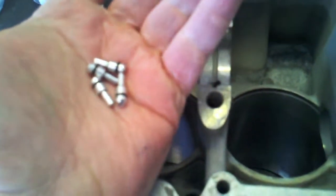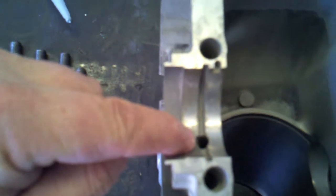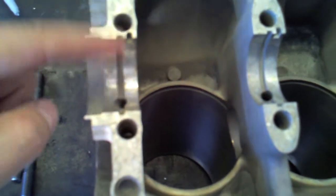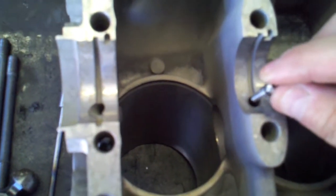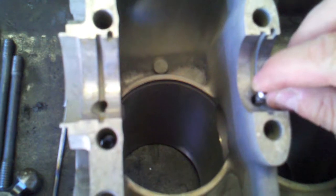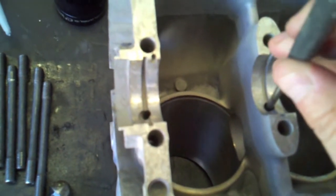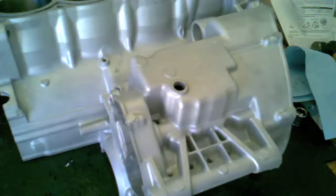I called up Millennium and they knew right away — these sit down into the oil ports in each of the journal bearing seats and help restrict some of the oil flow coming in to the journal bearing. The smaller end drops right in. I have a punch that fits nicely in here, I tap it down, I can feel that o-ring slide down the surface, and then I can hear when it bottoms out.